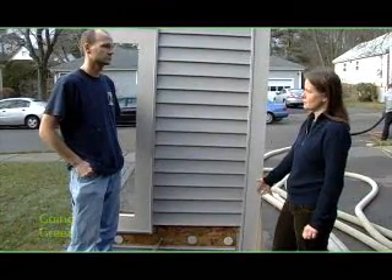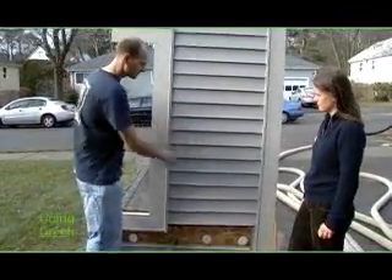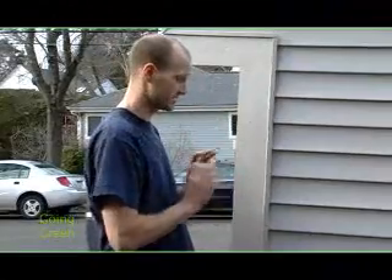So what's the impact on the cosmetics of your house? Vinyl siding such as this is ideal — it's very removable and reinstallable without any damage at all; you'd never see it again. They plug the holes with styrofoam for a good watertight, airtight seal. And you can equally do this with any other kind of wood siding — the only necessary thing would be to paint over the nail holes that you might have to create. But it's not a big deal. Cellulose fills all around everything and makes a nice airtight seal.